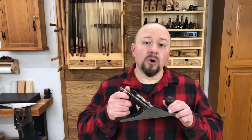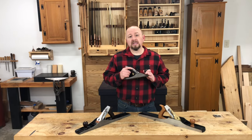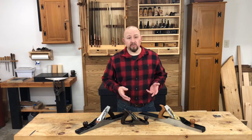If your budget is $75 or less, I'd recommend looking at antique planes like this one. Good old planes like this old Stanley No. 4 can be found almost everywhere. Most planes like this require very little in terms of tune-up. Most of the time, all you have to do is clean off the grease and rust and sharpen the blade.